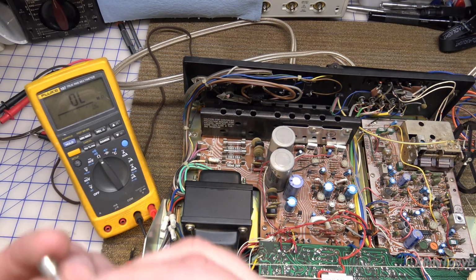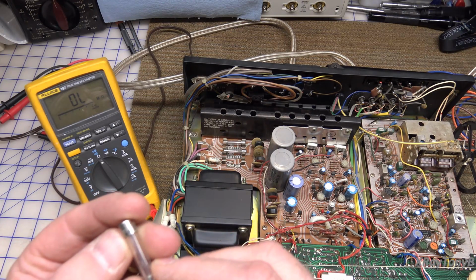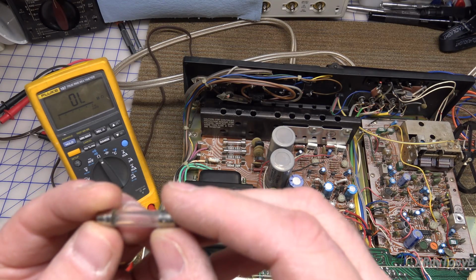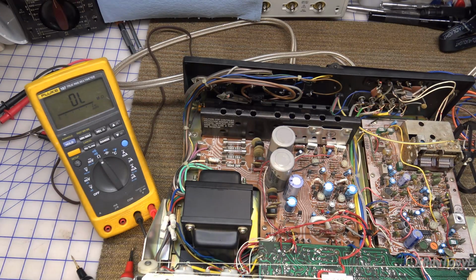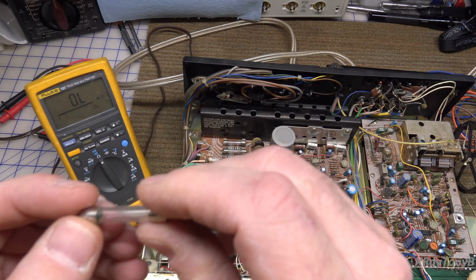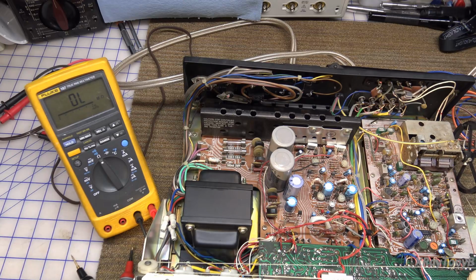So this is 250 volts, 500 milliamps. And you can see, well, that looks like crud on the outside of the fuse. So it doesn't look like it's obliterated. It just looks like it opened, but it doesn't look majorly exploded. So that means there's not a dead short, and that makes sense because it worked for a little while.